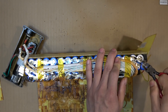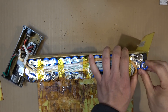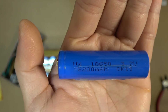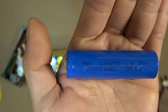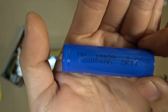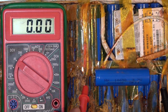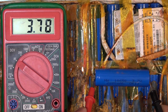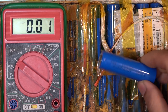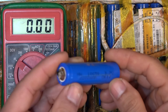Let's try and remove the first cell here and see what kind of cell it is. It reads HW 18650, 3.7V, 2200mAh, OK11 — no brand name on this cell. Let's see how many volts we get here: 3.78 volts, so it's still good, hopefully. I'll put this in my charger and do a stress test to see how many mAh I still get out of this cell.